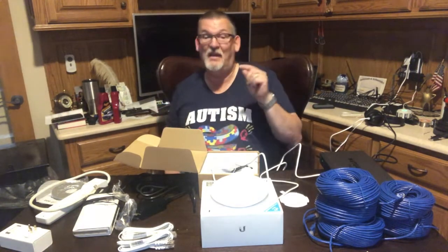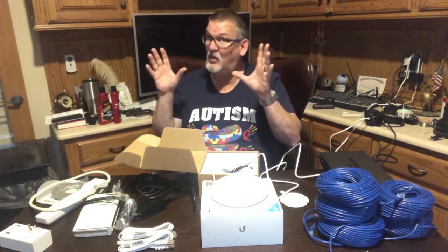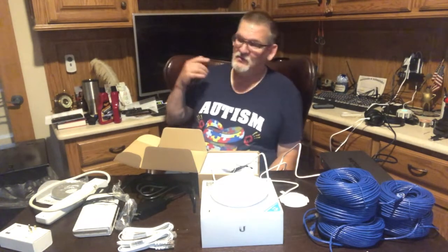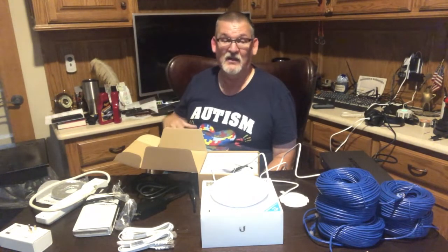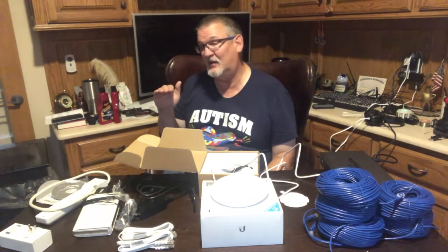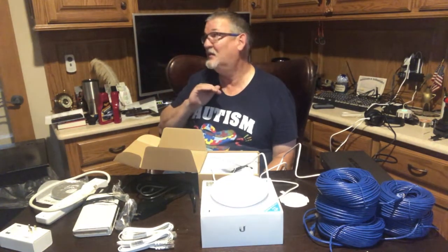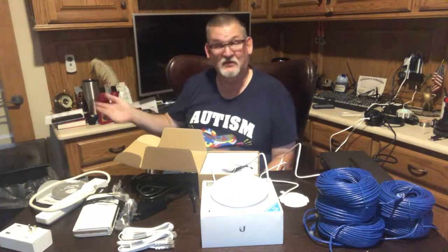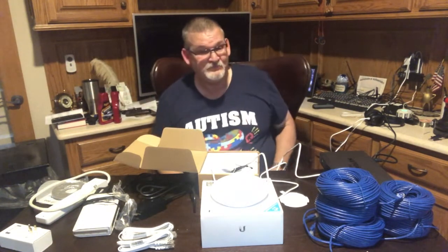If it's not seen by the app, your phone should see it as a Wi-Fi device. I don't think it'll be set up for any kind of internet, but your best bet is to use the computer, get it set up on the app, and get it to join your network. What I do with all my access points is I use the same password and same SSID, and then no matter where I walk around, my portable devices, like phones, will move to whichever has the strongest signal as I move around.